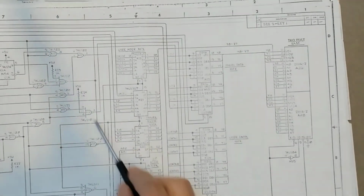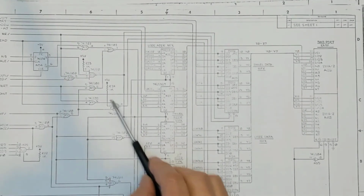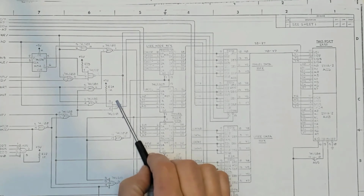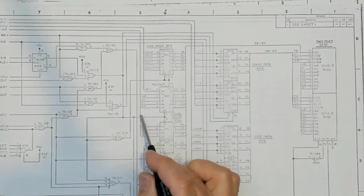So when I saw that, I was really glad that I didn't start a beef with the viewer, saying that he didn't know what he was talking about, because he obviously does. It's pretty apparent that unless Intel had a surplus of 7410s to use up, this was certainly a design feature and not an oversight. Since all 3 gates in that chip have that fixed tie-up input, it was certainly intentionally put in for diagnostics or testing.